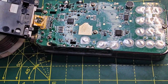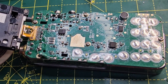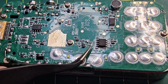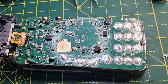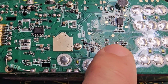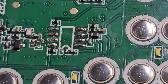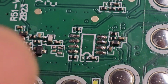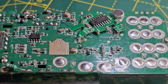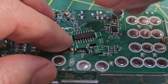The tiny one we're going to fit, I'm going to do that right at the end. I'm going to do everything else and do that last, because I think that'll build my confidence as I solder. So the next thing I'm going to do is try and remove this chip here, and these two here have to be removed. These two and this chip. I'm not recommending it, but I just snipped it off because I found it a lot easier. It went flying somewhere, but it's off, and I'm going to do the same with these two components here. So I've snipped off those two devices. I'm going to dab those 8 components just here. Dab them just with solder, just to make sure they're good for connecting to, and some flux. I have been cheating and using my snips to snip things off, but it's worked so far. And the next step is to get this board in place, in the correct place.